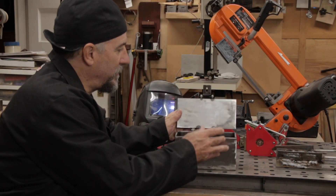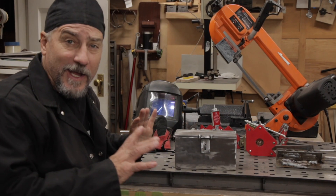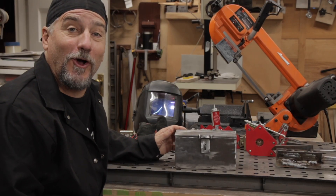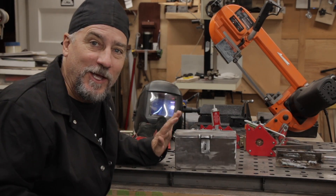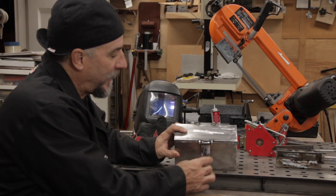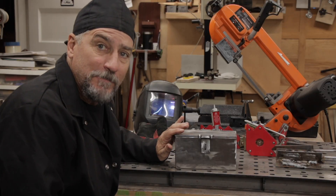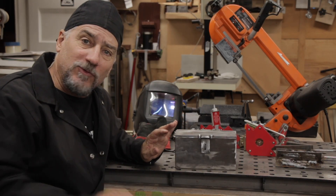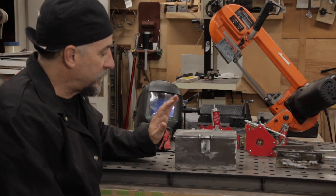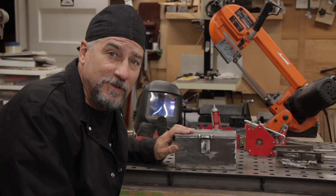The old metal box came together despite all those ugly welds I had going on, but that's okay — I'm here to practice and get better. My grinding is improving along the way too. For you beginners, go ahead and give this a shot; the hinges and the latch are kind of fun, and you'll get to practice vertical welds, horizontal welds, and spot welds. The more you do, the better you'll get. For you veterans, throw some comments and tips down below so we can learn. I hope you liked it, thanks for watching — hit that thumbs up and subscribe button!